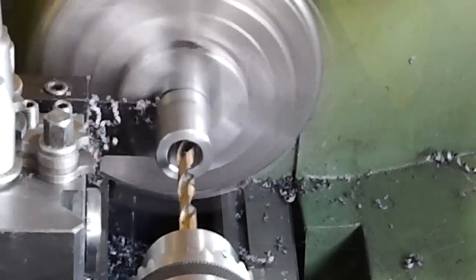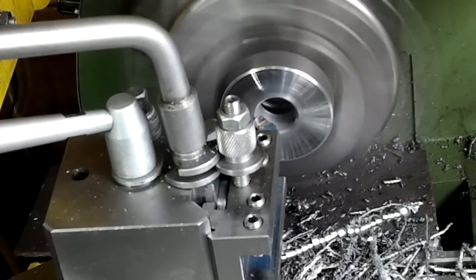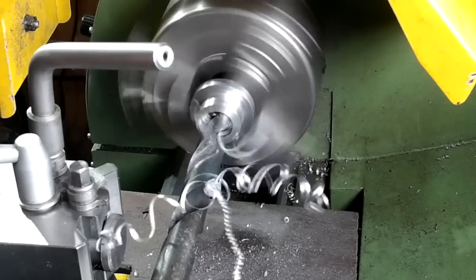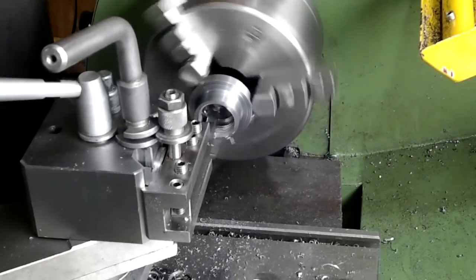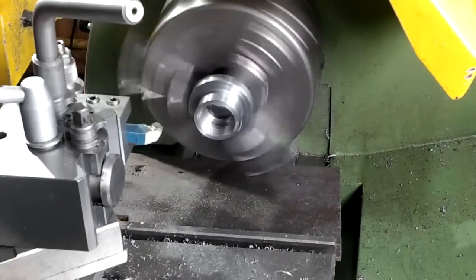This is where I make a collection of sleeves and bushes that go together to provide packing and support for the gear blank. There's also a couple of items that go to hold the indexing arm in place. This will be the knurled hand locking nut that holds and supports the index arm.